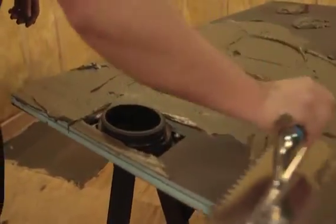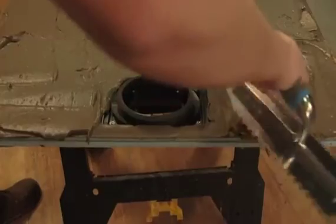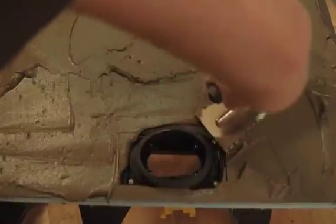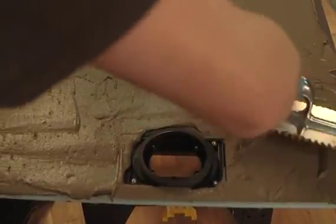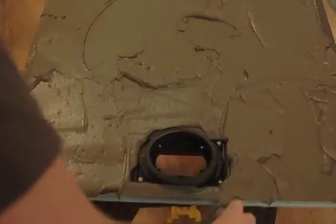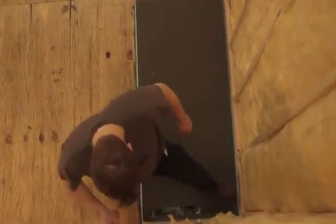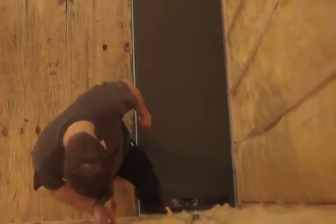In any case, it will be helpful to spread thinset flat into all surfaces before combing through the mortar using the notch side of the trowel. All trowel lines should point in one direction and toward an open area to allow for air to escape from between the mortar ridges once these collapse under pressure when the base is installed to the floor.